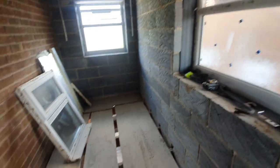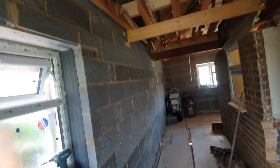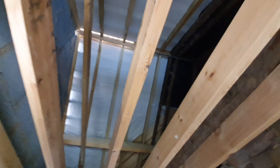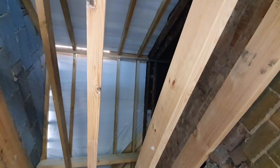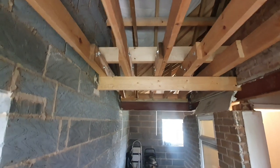So this is going to be the new bathroom area. The old window is coming out. If you look out here you'll see onto the street. You can see the porch down below where there's also going to be another bathroom directly below us. So the roof is in. We've pretty much matched the rafters to the existing — they're a little bit thicker — but the ridge board is considerably thicker than the existing, and the purlins and binders are also a lot thicker.